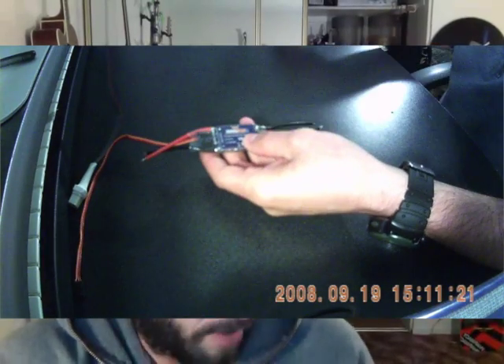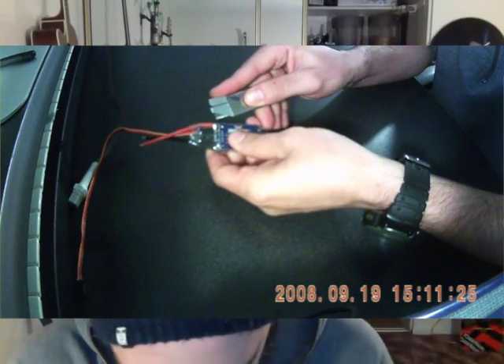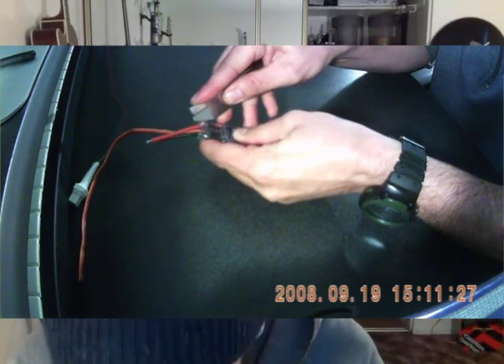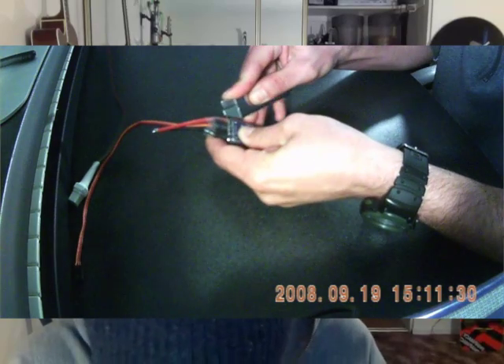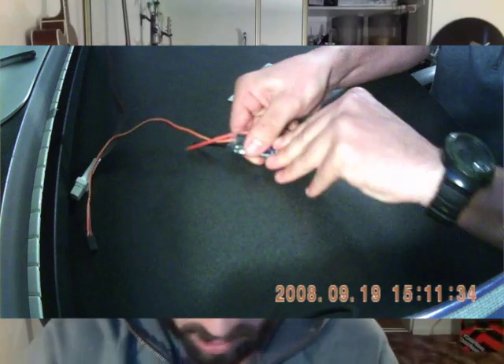As you can tell, this has a clear shrink tube on it. Getting down to the actual process of flashing ESCs, you're going to take this shrink wrap off. So take your trusty razor and you just kind of want to gently get this thing off — try not to cut anything, including yourself, as you get this off.